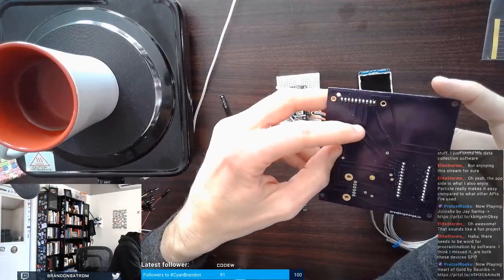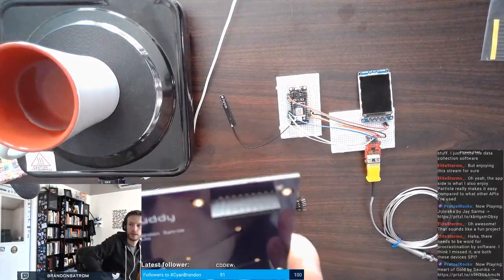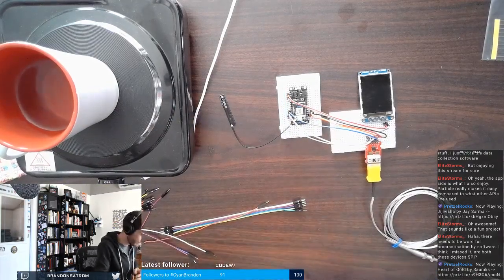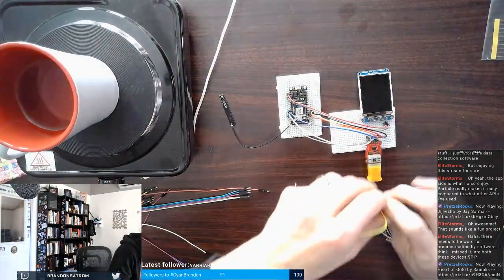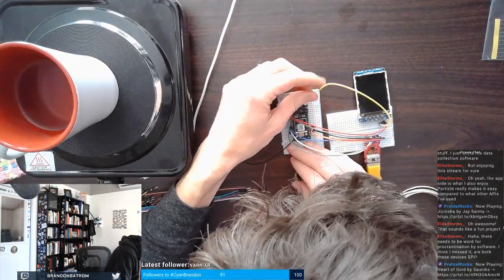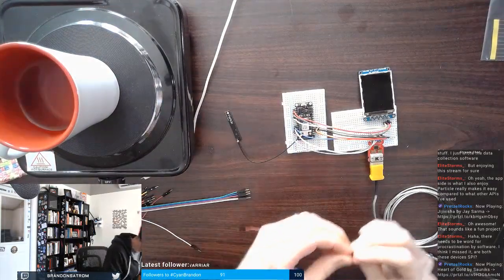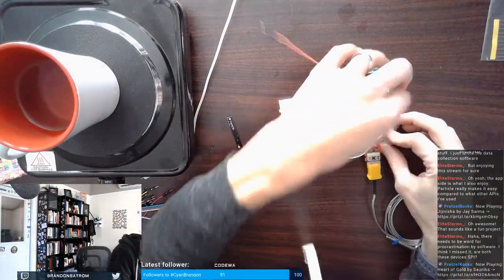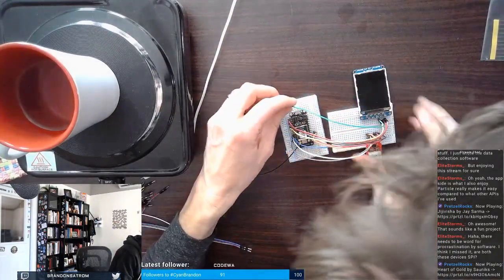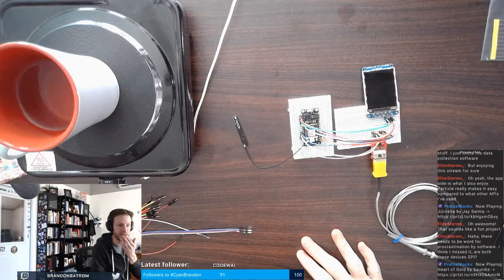So I'm just going up the line here. The next piece, ground, power. My third pin is DC. Remind myself what DC means. Oh, DC was on A1. Okay. Some of these I don't need for the purposes of right now, but oh yeah, and reset was on A0, which is my next one. Reset, A0. So many wires. And chip select was on A2.